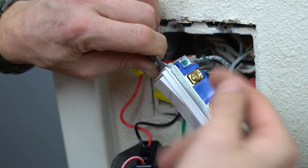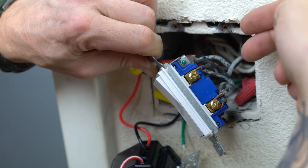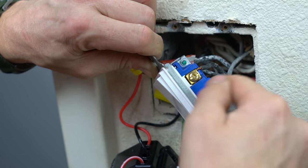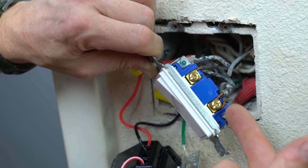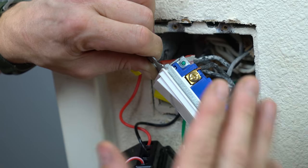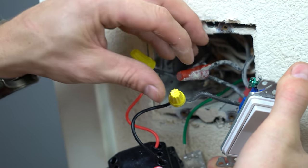I mean, these things are designed with a plate, so you put the wire behind it, and it's even got two slots so that you could put two wires behind it. Rather than doing that, whoever put this in just stripped out this part of the conductor, had to cut it out with a knife, probably took way more time just to do that, and then wrapped it around the screw, which again is okay. It's just kind of shitty that they have all these different points of a hot